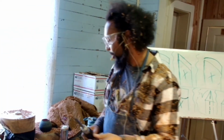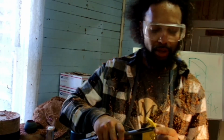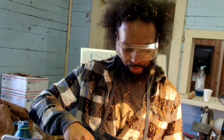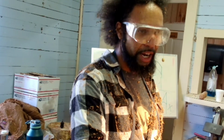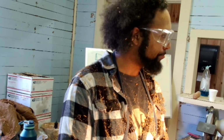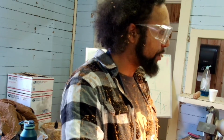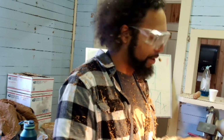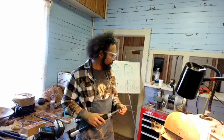So what I have here is on this grind for the secondary bevel, that is from the heel to the secondary. That's probably about 40 degrees. That's good. So that means that by and large I'm entering the cut at a 40-degree plane. Which is to say that if this entire bevel were ground at 60, I could make some first initial cuts, but then I'll be raising the handle extremely, like this, because the plane is entirely at 60 with that bevel. So it's always going to be better to start at about 40, 45 degrees. That's going to be a little bit better.